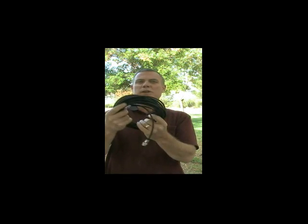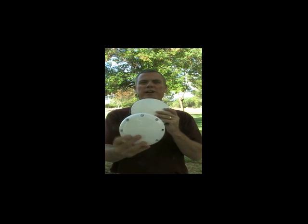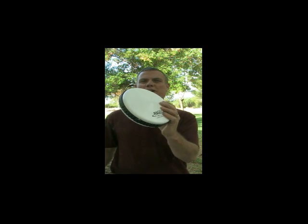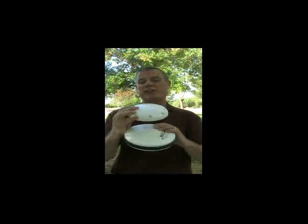It comes with a 10-meter antenna cable which will suit just about any application. This is standard off-the-shelf coaxial cable — many people have shorter cables and you can get those as well. We offer two geodetic antennas right now: one is great for machine control, marine, and possibly airborne applications, and the other is more of a standard survey form factor. Both antennas track GLONASS, GPS, and SBAS satellites.